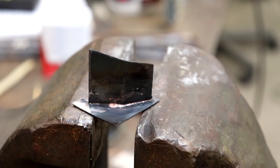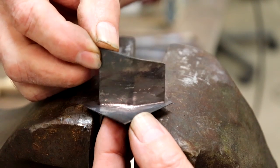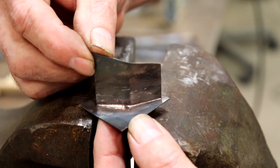I'll go back and pick some up. There it's all the way at the end. And there you can see it's a very fine joint where the copper has just wicked underneath the two pieces. Let me hit it with the wire brush and you can see how neat it is. That may be hard to see, but if I rock it back and forth and with the light refracting on it in different ways, you can see what a nice small joint that is.